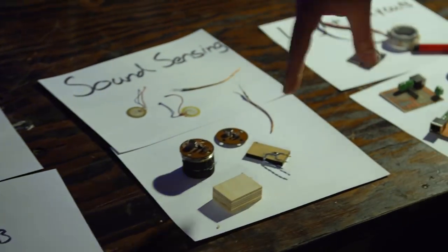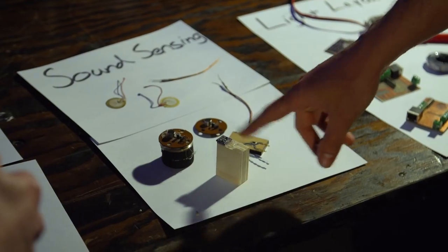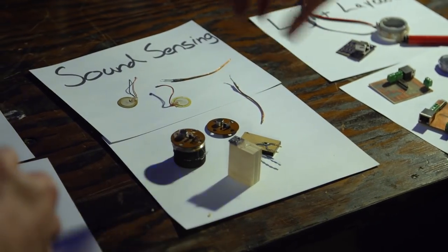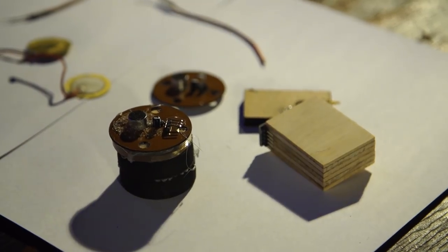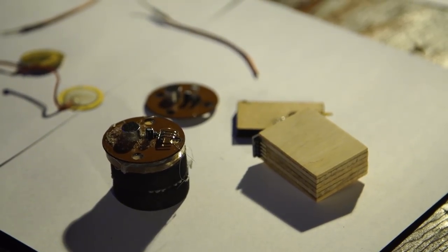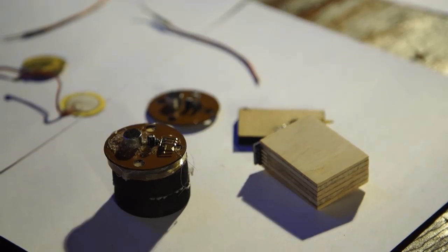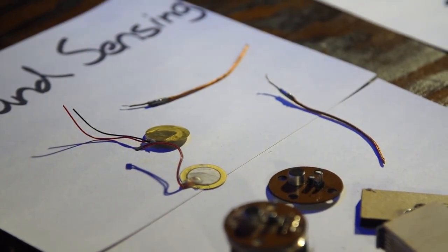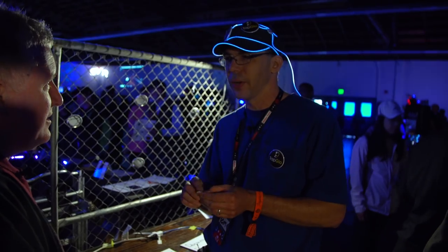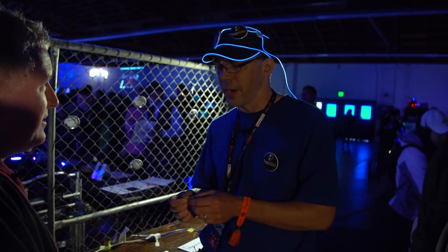These are different options for sound sensing — some digital mics and then piezos. We ended up sticking with the piezos, but also some condenser mics. A piezo, for people that don't know, is what they might be more familiar with as a speaker — like inside an old computer that would beep, or an ATM buzzer. But when they vibrate, they produce a voltage, and it produces enough voltage on the table to trip the signal.